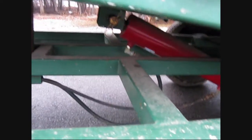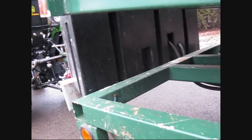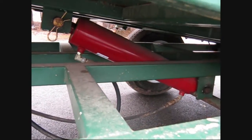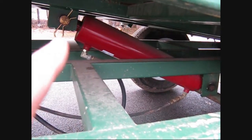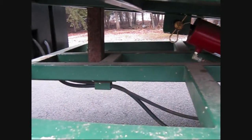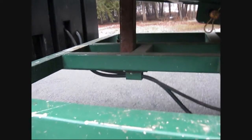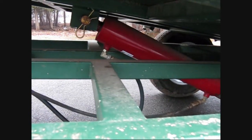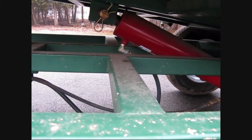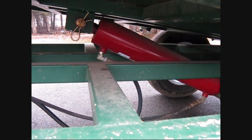Let's get a shot of the hydraulics in here. This trailer originally came with the electrics in the box with the batteries. I don't know who designed it with this kind of a lift — from this bottom point here to where it pushes on here. The ram — this is where the trailer's got to sit because of the length of that ram, because that's the only one I could get for that size. Normally this should sit right flat. The ram actually sat down too far, so it would have to push forwards before it started to push up, and the one they had on there just wasn't enough power. You could only fill this thing up to maybe about half way — if you filled it up anymore it just wouldn't lift it.